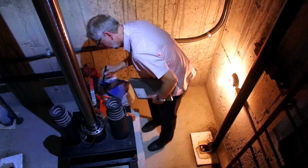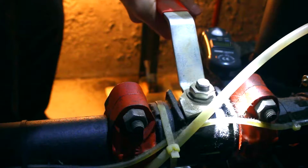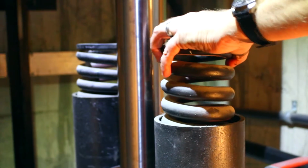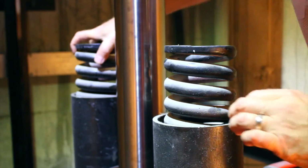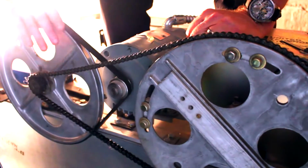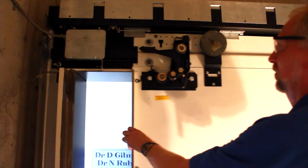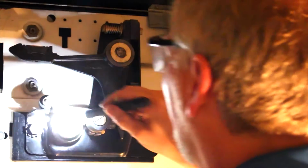The elevator pit, or bottom of the shaft, contains various components such as buffers, counterweight guards, and the bottom of the rails. A common problem here is water infiltration, which leads to mold and odors. From the top of the elevator, we can take control of it and move the cab through the hoistway, or shaft, observing the back of the landing doors, door operators, ropes, and other components.